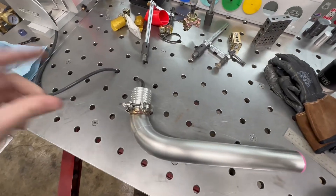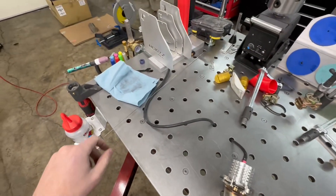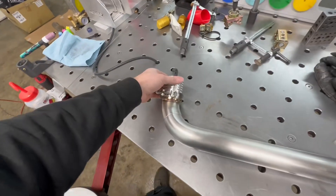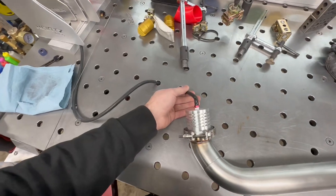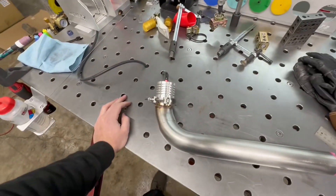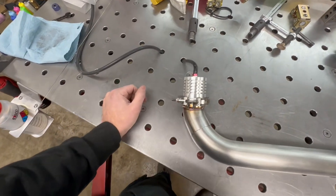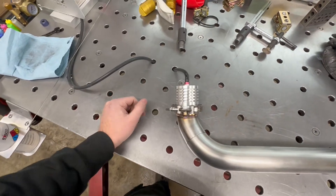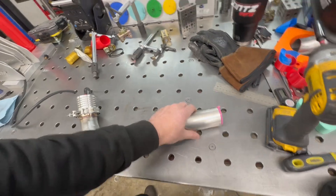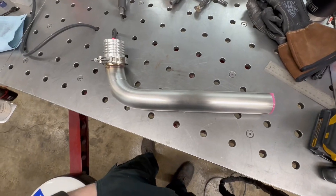If you aren't familiar with welding stainless steel, you really have to back-purge it — including the tacks, preferably. My back-purge setup on the table is just a smaller tank of 100% argon feeding argon through my heatsink. I had these heatsinks made by a friend to match the TurboSmart wastegate and the Garrett turbo housing I'm using. It really helps pull heat out of the tube and protect the V-band flange from warping. I'm also using TIG Aesthetics purge plugs on a little rack that I had made by Senca — a pretty neat little setup that's worked really well.